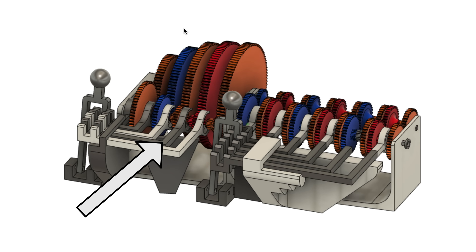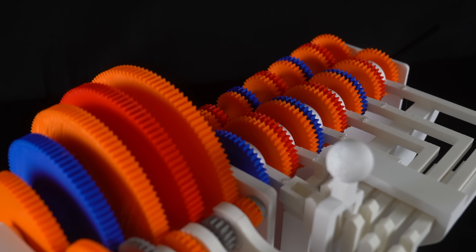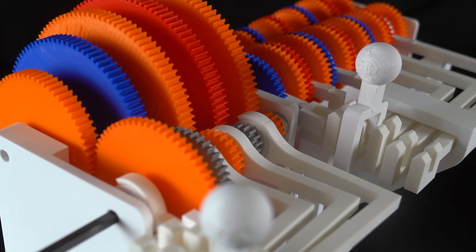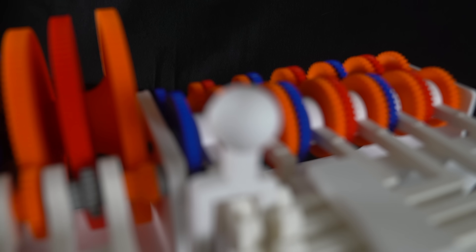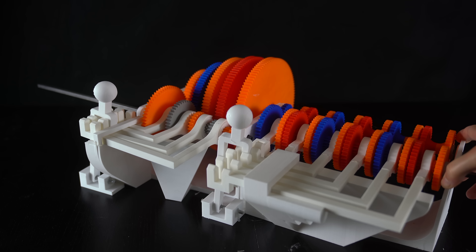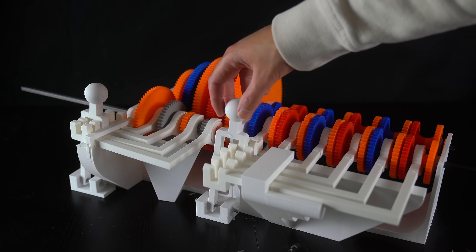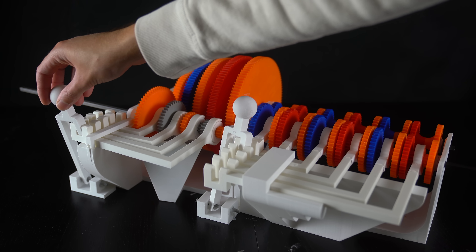Now we have the two stages: the first stage with 12 individual gear ratios, and the second stage with the mega gear multipliers. The result is a 60-speed manual transmission with dual shifters, utilizing a 12-speed front box and a 5-speed high gear ratio multiplier back box.